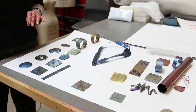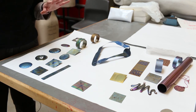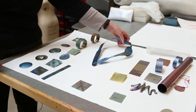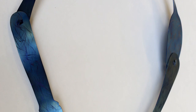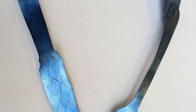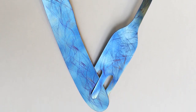One of the earliest uses for stainless steel was cutlery — this was celebrating a hundred years of stainless steel. I decided I would make a cutlery neckpiece, so we have a knife, a fork, a spoon, and a dessert fork, and they are hand cut from titanium sheet, then heat coloured using the random filing technique to get a bit of pattern. The fork acts as a closing mechanism at the front.